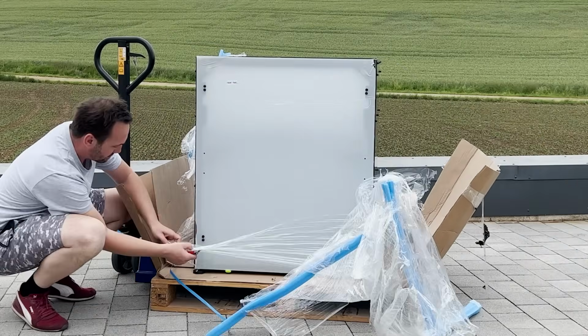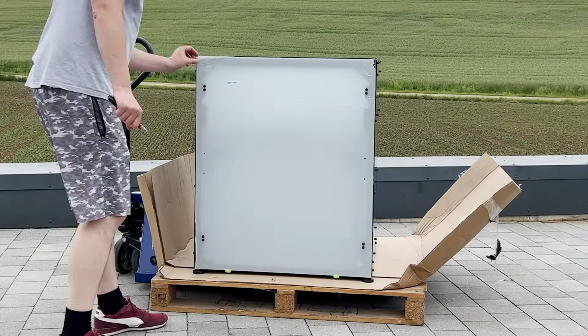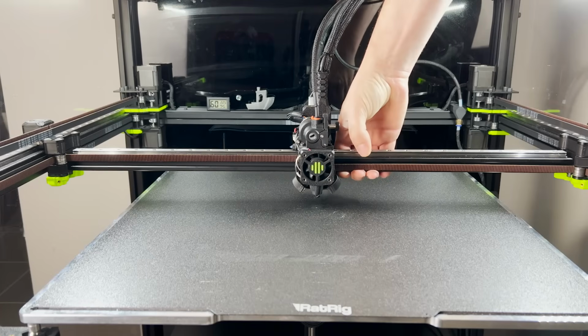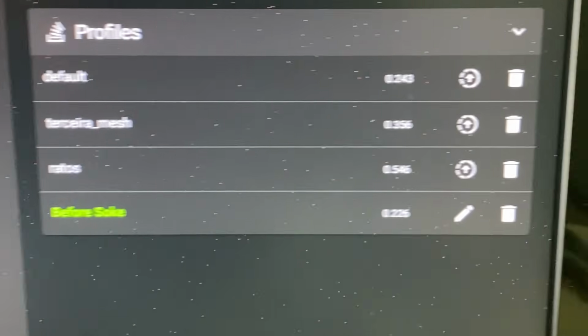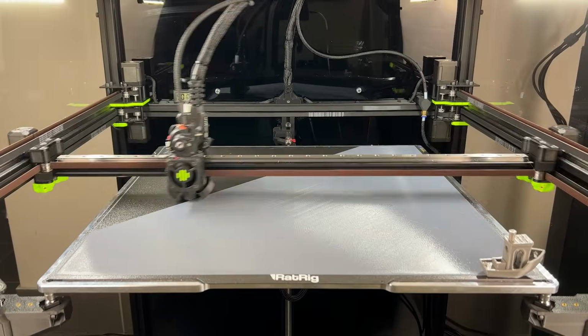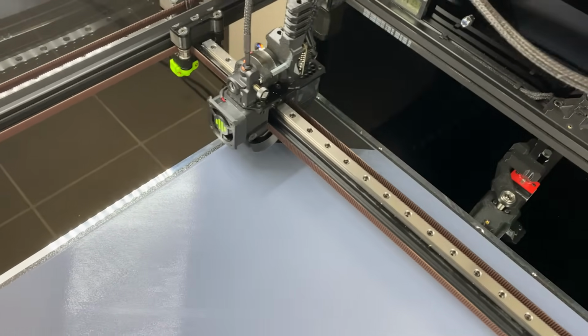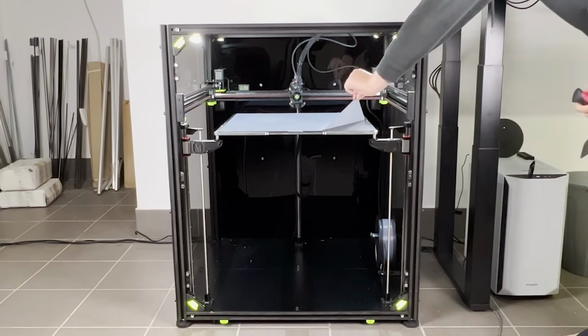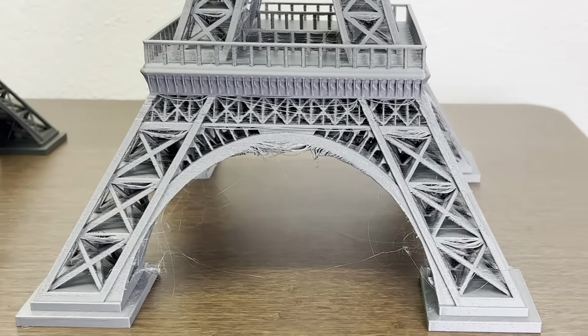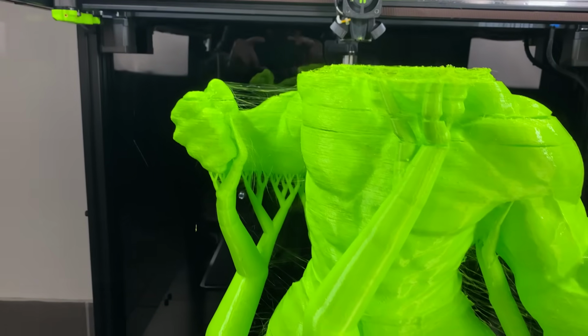Additionally, there was a significant sag of the X-axis due to the toolhead being parked at the center of the beam during transport. Applying a bit of vertical force corrected this mostly. Eventually, I managed to print an almost perfect full 500x500 first layer. Nice! What wasn't nice were my initial attempts at printing models.